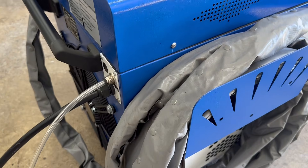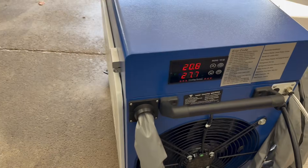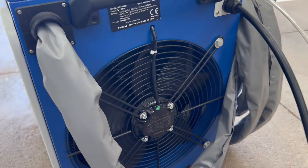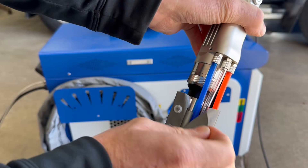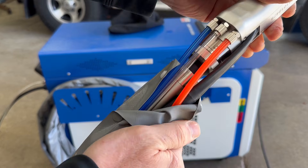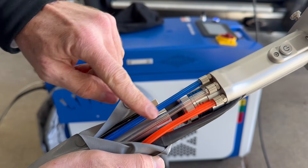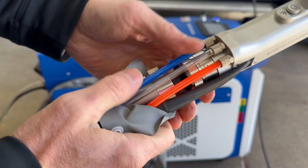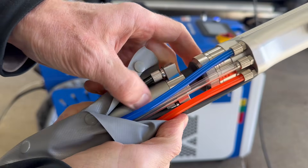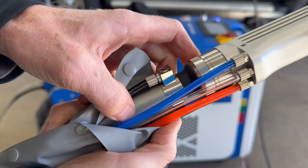The compressor has shut off, and you can hear this machine itself is actually really quiet. Once in a while during use, the fan in the back will kick on, and that's not even that loud. Inside this gray cover you have all kinds of cables — a cooling line going to and from the unit, an air line, some electrical wires, and this big one in the center is the actual optical fiber for the laser itself. That's the main thing that you don't want to bend too much.